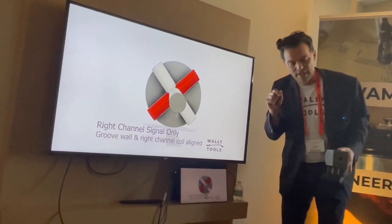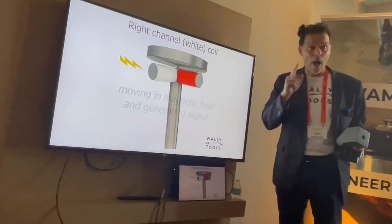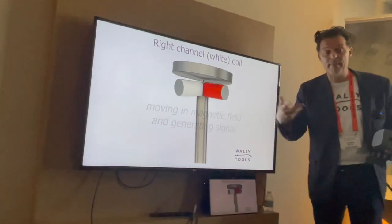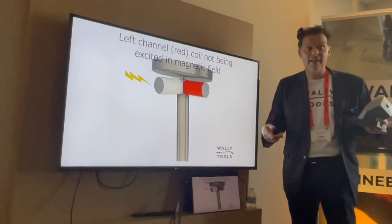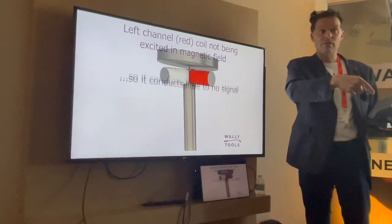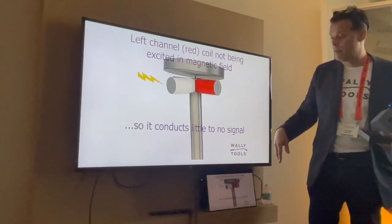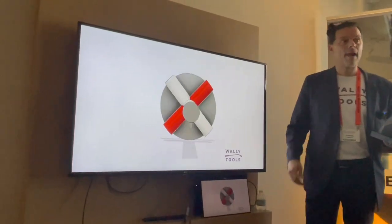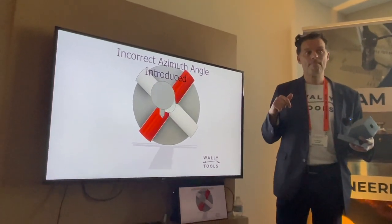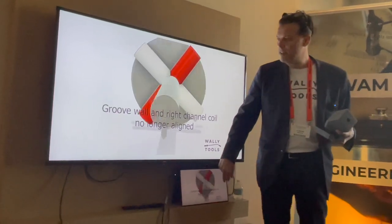And because it's done electrically, it must be the last test we do. All right, why? Because it's a multivariate test, meaning the answers you get from that test will be stained by any error on your other parameters. So fix those first before you do this. Otherwise, it will throw off your reading. So crosstalk is, if you're reading the right channel, you're listening to a little bit of the right channel on the left. That is correct. Yes. Okay.